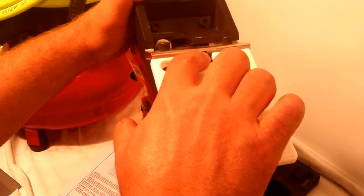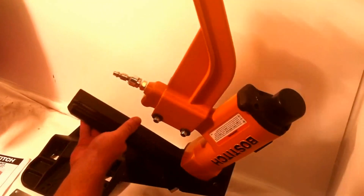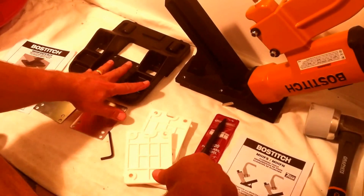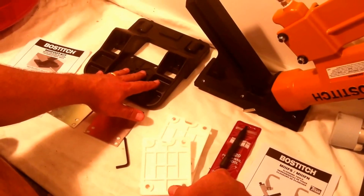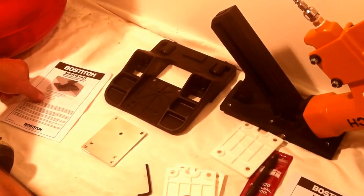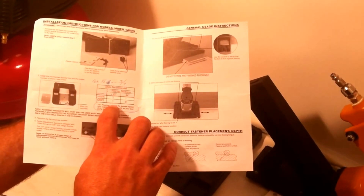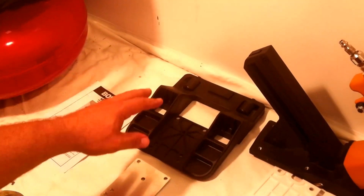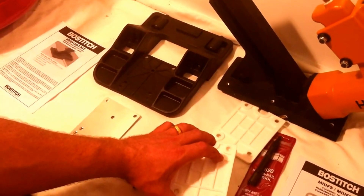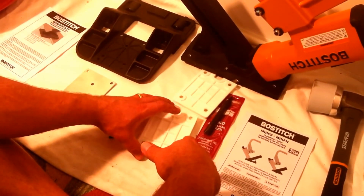You can also see where the nail heads are coming out when you do your impact. There's also a flooring kit that allows you to roll along the edge and drop your nails in, with a shimming system versus a pad system to allow this to go to the right depth. The manual will explain the shimming portion and what thickness you want. Unless you're experienced or mechanically inclined, I would stay away from this feature. Most guys that rent this machine just prefer to manually do it and reset it every 6 to 8 inches as they drive another nail in.